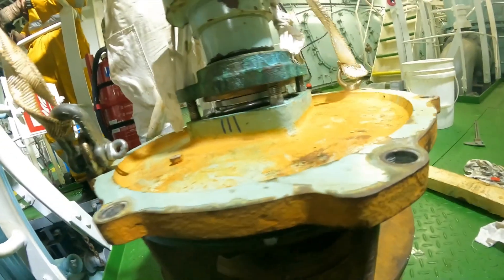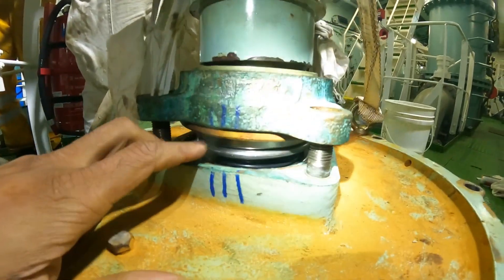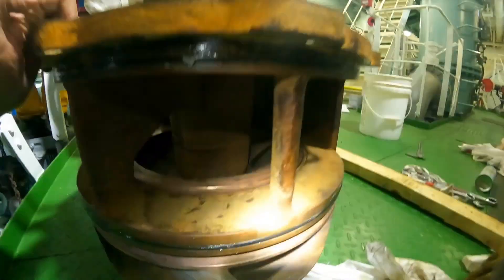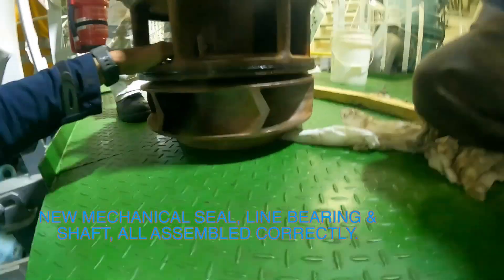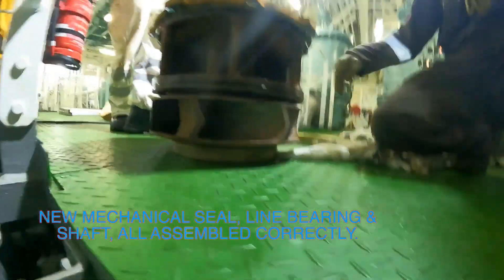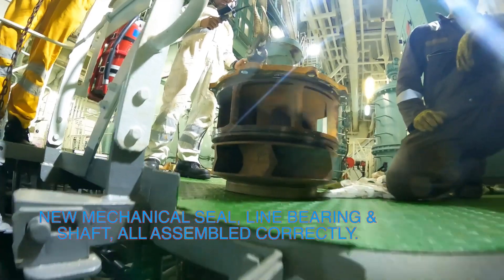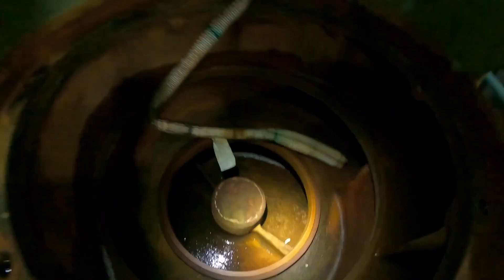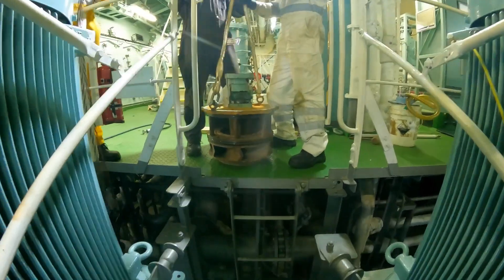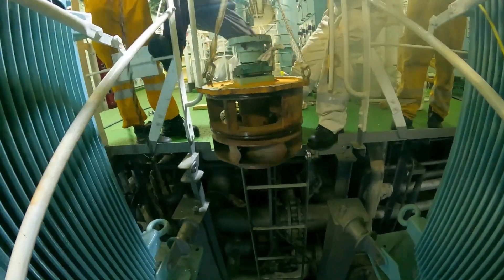So we are back. The pump has been assembled with a new seal on the new shaft. We're just checking the spring tension and looking at the marks. Lubricating grease has been applied on the O-rings. The impeller is good to go, assembled with the new seal. The casing is clean — absolutely clean, inspected — no broken parts, no damaged parts. Let's lift her up and put her back in.